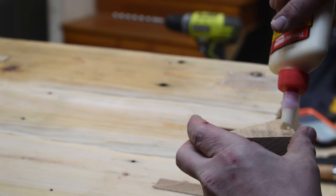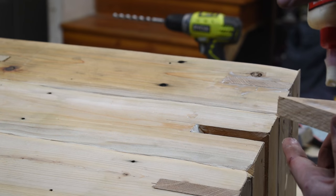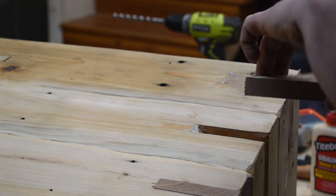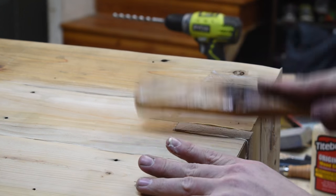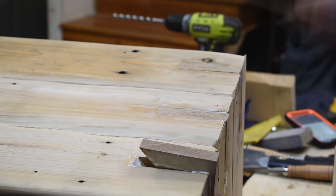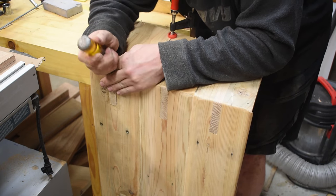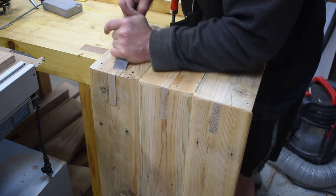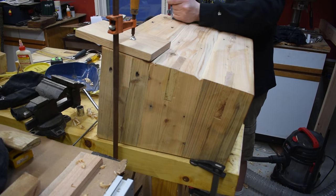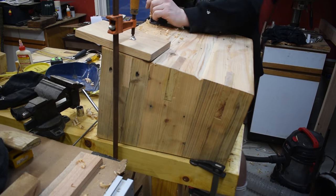I just glue the slot that the spline is going to go into, put some glue on either side of the spline where it will make contact with the laptop stand, then knock it back into place. There's really no need for clamps because they go in very tight — they're not going anywhere. The tool I'm using to knock the splines in is actually the handle from a mallet I made and then broke. Then I come in with a chisel to start shaving off the end grain of the splines to make them flush, and quickly realized it would be a lot easier to use a plane, so I come back with my number four Stanley plane and shave all the splines down to make everything nice and flush.